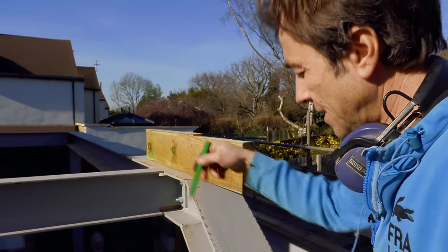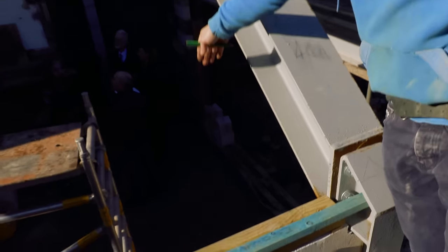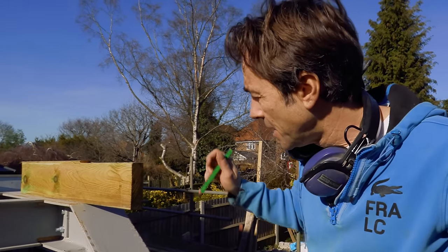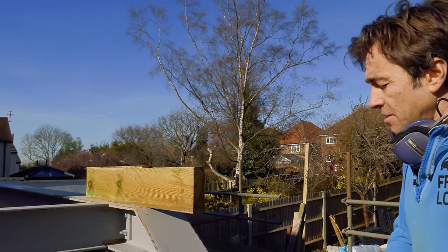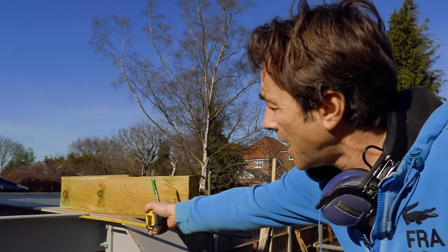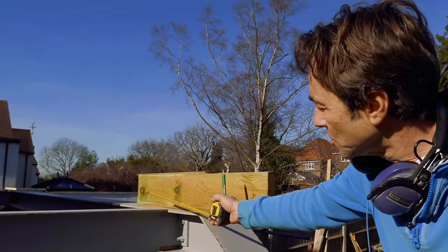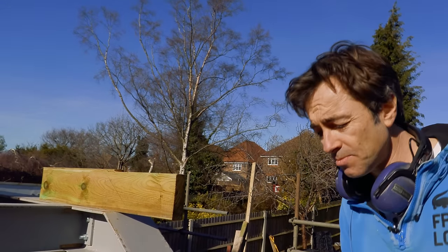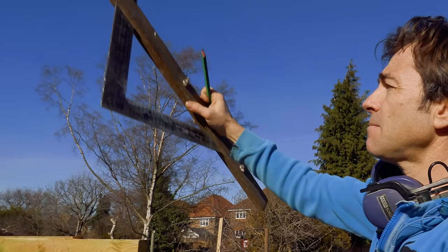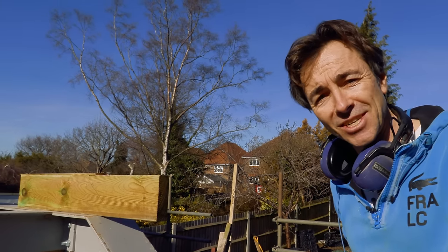The other thing I need to do is measure it up. Normally I use a simple calculation: the run — which is the level run — multiplied by the degree of pitch, or actually the diagonal measurement for that particular degree of pitch. What I'm going to do here is called stepping off. I've made a little drawing for myself with all the dimensions. I've used the level to check back the distance from the front edge of the steel to the outside edge of my plate, and I'll use the roofing square stepping-off method up the rafter.